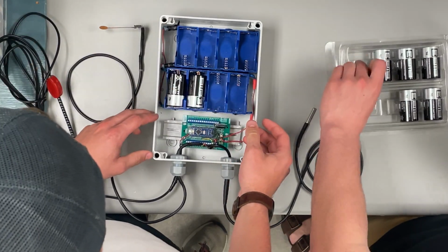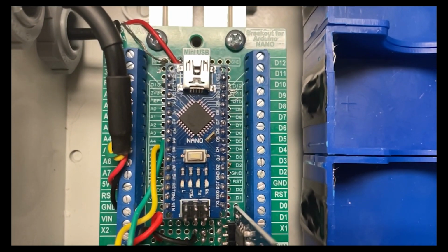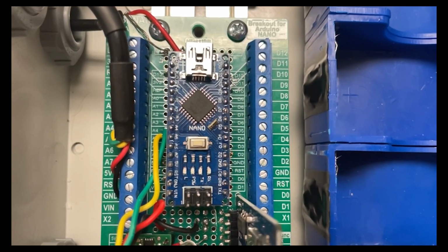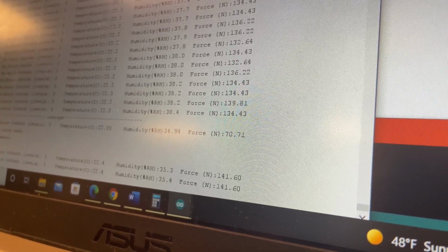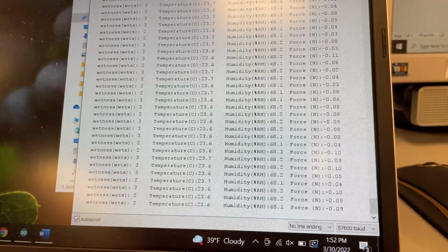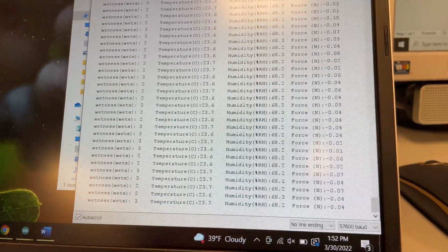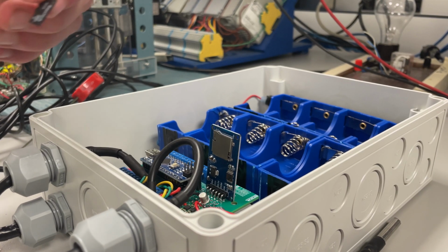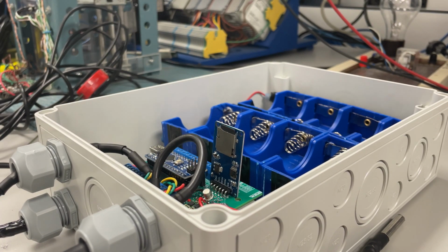To control the system, we used the Arduino Nano. We chose this board because it offered low power draw while still having enough I/O and processing power for our purposes. To lower the power draw even further, the microcontroller will enter a sleep mode that disables the main oscillator timer, SPI interface, I2C interface, and the ADC. In order to interrupt the sleep mode while the main oscillator is disabled, we can utilize the watchdog timer to create a 1-hour interrupt. The code will interrupt the sleep mode hourly to take 100 readings, average them, and then store the results to the micro SD card.